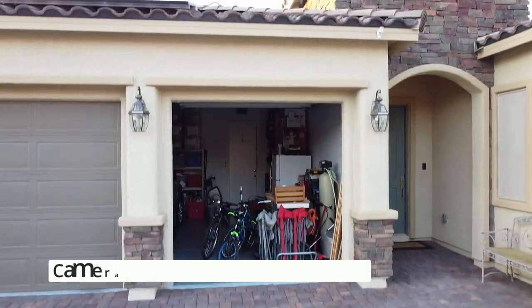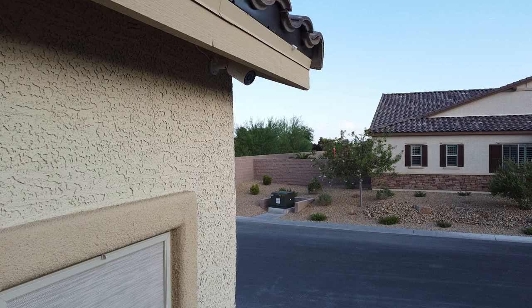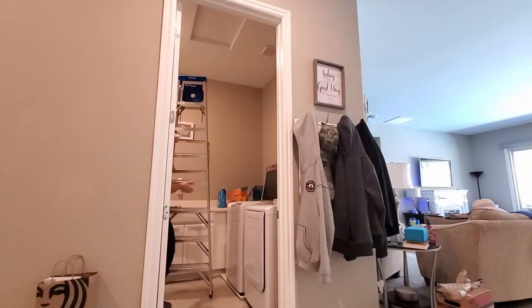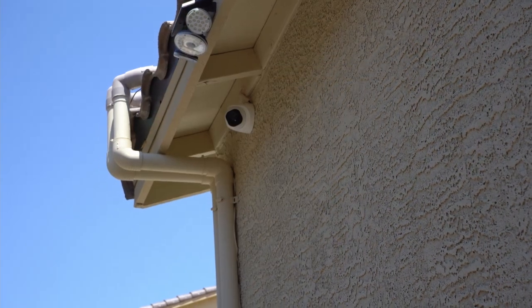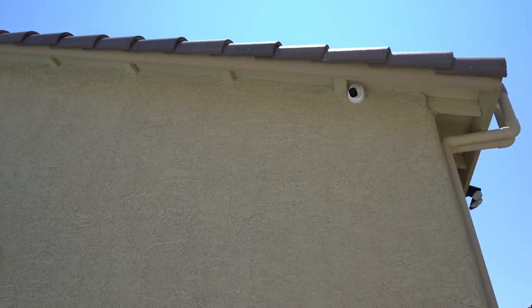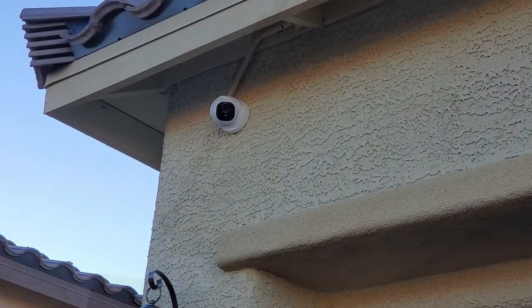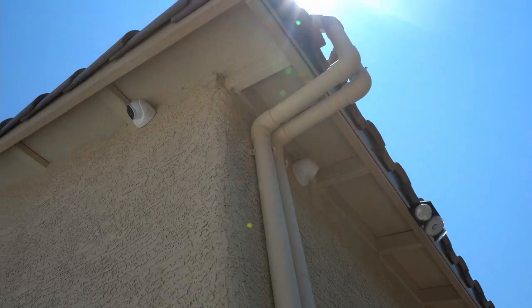Here are a few things to remember when installing these cameras. First, make sure to choose the optimal location for each camera so each camera covers a wide area. Second, when running wires through the attic to your camera locations, use shielded Cat6 wires, and go ahead and run two wires to each location. That extra wire provides the ability for expansion or if one wire fails you have a backup. Most importantly, try to install the cameras over the holes for the network cables, or at least as close as possible — otherwise it looks messy and sloppy.